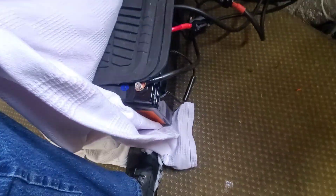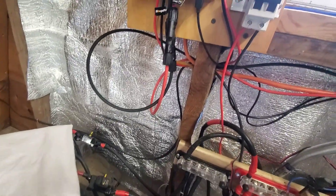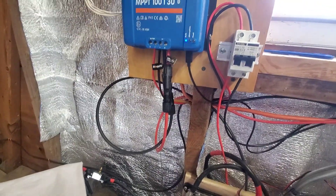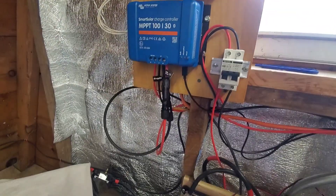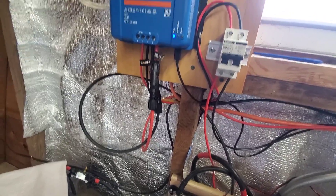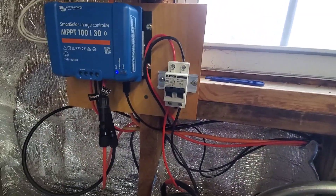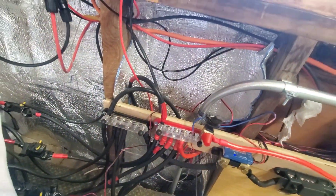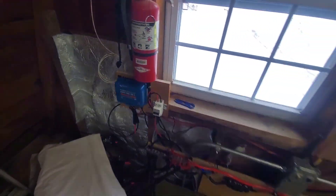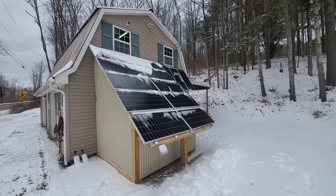The batteries are individually fused. I left some quick connects on the panels coming in so if I want to charge my portable power packs I can just plug them right into the panels. I've got a disconnect outside and I added another 30-amp breaker that goes to the charge bank. I'll take you outside and show you the panels we added.